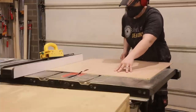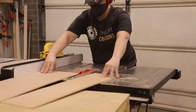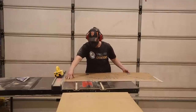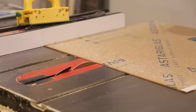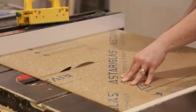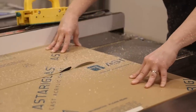With all the pieces of the box cut to final measurement, I could turn my attention to the 6mm plywood and cut the back pieces to size. The last piece of the puzzle is the Perspex, which is cut to the same size as the back panel. The great advantage to using Perspex is you can cut it on the table saw using any regular woodworking blade. If you have a SawStop, you don't need to override the brake cartridge — you just don't want to make the cut too quickly. Nice and slow works best. Keep the protective paper coating on the Perspex for as long as possible to avoid it being damaged throughout the build.